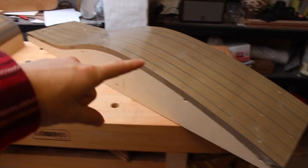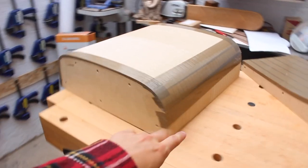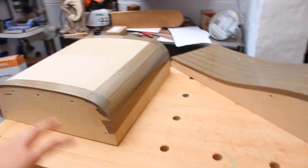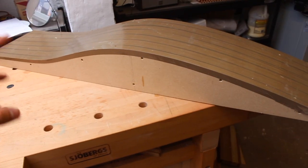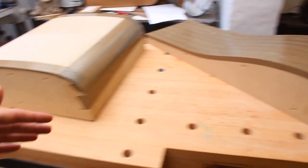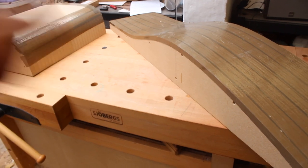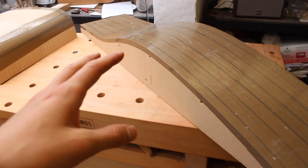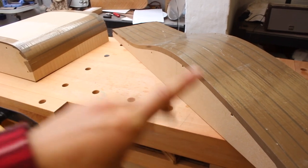Here are the two moulds complete. As you can see, this mould is for the seat back — it's got a very nice curve to it. And this one is for the seat itself. Now these are pretty heavy; they're made from solid MDF, but they'll last a long time and I can reuse these moulds. These moulds can be used in a membrane press or a vacuum bag, but for this chair build I'm going to be using a membrane press. And the next chair I'll make with these moulds, I'll use a vacuum bag to show you the difference.